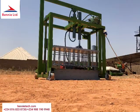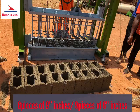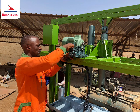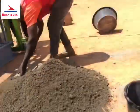Hi, my name is James. Let me quickly introduce you to Ben Agro's block molding machine. The machine is capable of laying six pieces of nine-inch blocks and nine pieces of six-inch blocks. The machine is run by a 3 horsepower vibrator and a 5 horsepower electric motor to power the hydraulic rams, all powered by electricity.